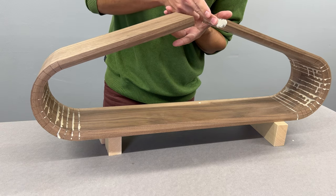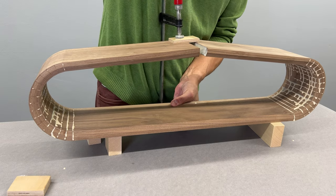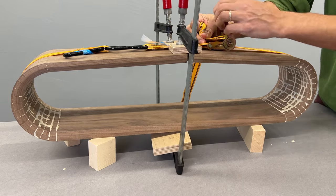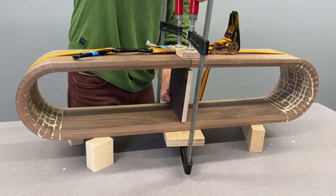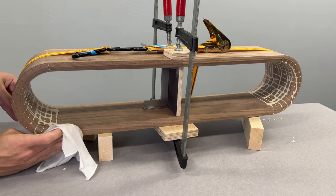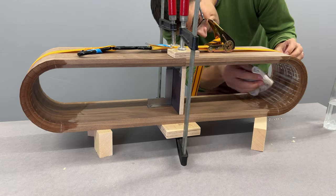I added some glue before closing the gap and clamped well. I took into account that the wood glue would add extra thickness in each cut, so I needed a bit of force to squeeze all excess out by bending the shelf into the needed form. A pair of clamps and a ratchet strap did the job perfectly. A good clean-up of squeeze-outs with a wet rag saves a ton of sanding time later.